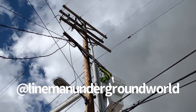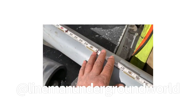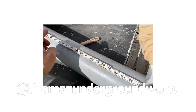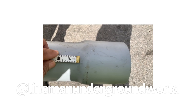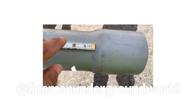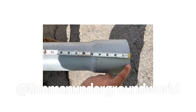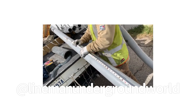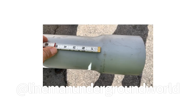58 and a half without the bell. Alrighty. Stand by. So we're gonna mark 58 and a half here. Or what was it, 59 or 58? 58 and a half. He said without the bell. So when we say that, that means this part here is the bell. We don't include it, so we just go right here to the base of it. But if he would have said 58 with the bell, we would have measured it from the end of the bell all the way up to that point. But he said without, so we're going from here. Just little things that we do that make things work right for us on the pole and building a riser.